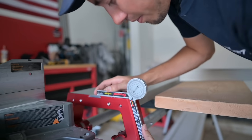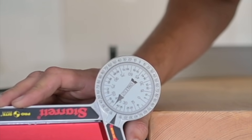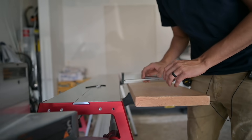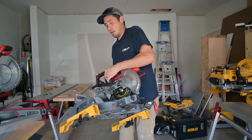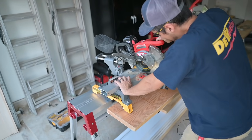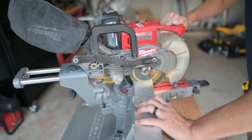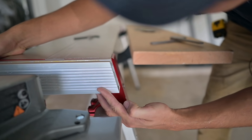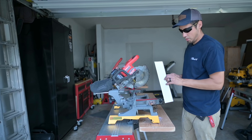We're going to put this up against the saw. Since we're on a single cut and not a miter, these things count in twos — two, four — we'll say about 15 degrees. I'll do a sample cut, make sure it lines up, then lock it in. To make these cuts I'm going to use this small Milwaukee saw — I cut track tubes on this all the time. We'll make sure our angle is good... looks like we're dead on, so we'll measure 10 inches over and chop the other side.